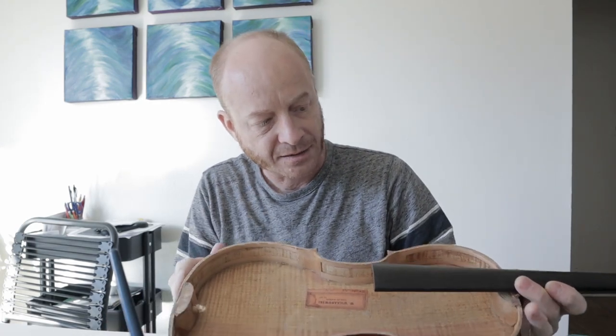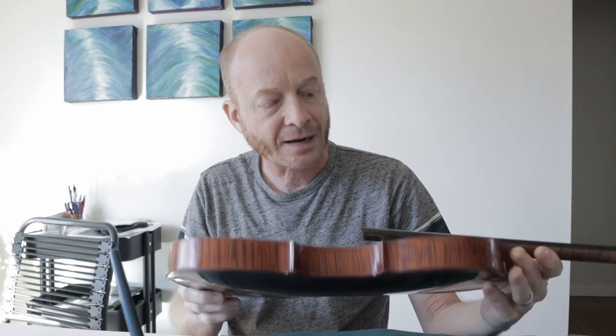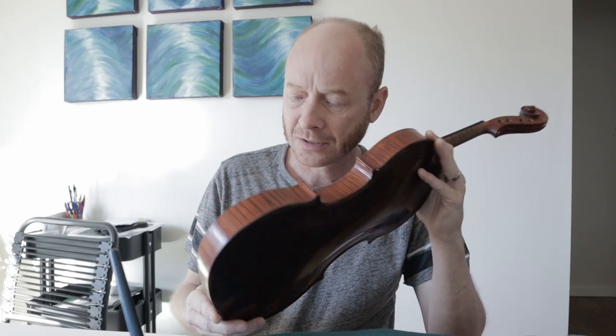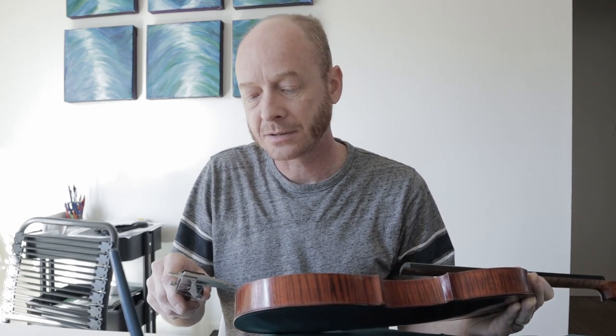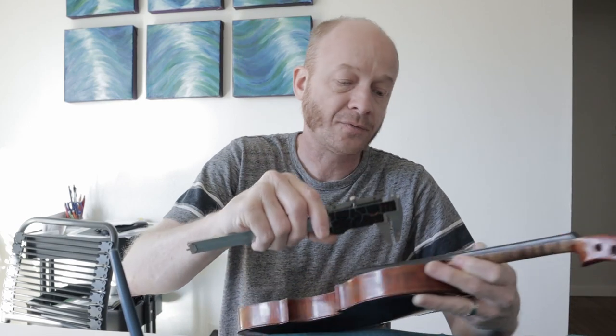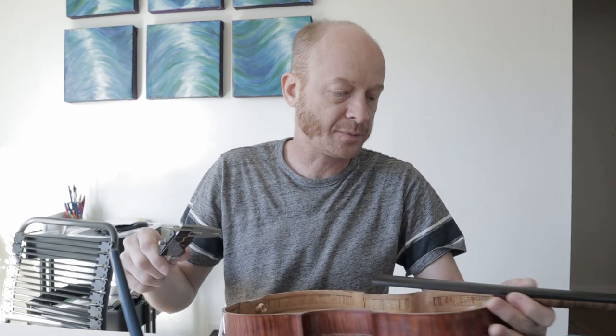Anyways, the cutback is an approximate shape of what they wanted the linings to be, but they cut it back a little bit more. So I'm just guessing that the lining goes back, it looks like here, about a millimeter. Let's see, how far does it go back? No, I'm out of my mind. What do we got here? 3.5 millimeters there. This one I can barely see the edge. Yeah, about 3.5. And the top here is recessed about 3.5 millimeters, they're all about that.